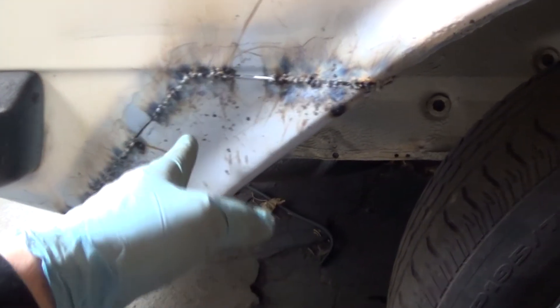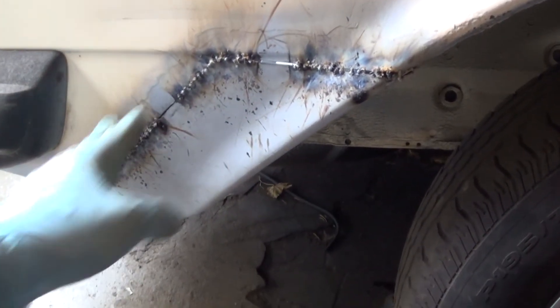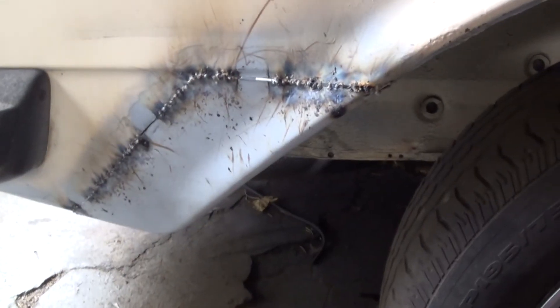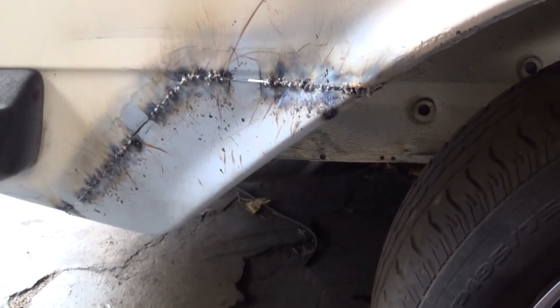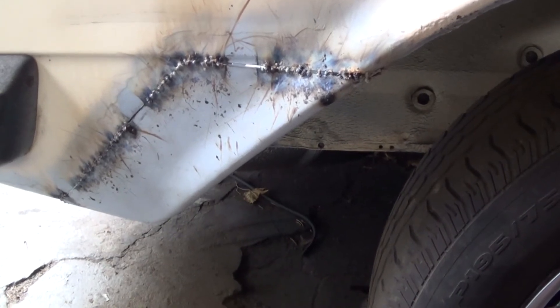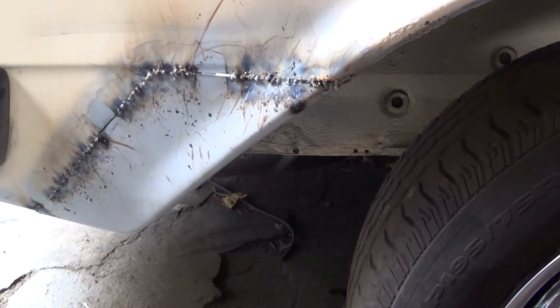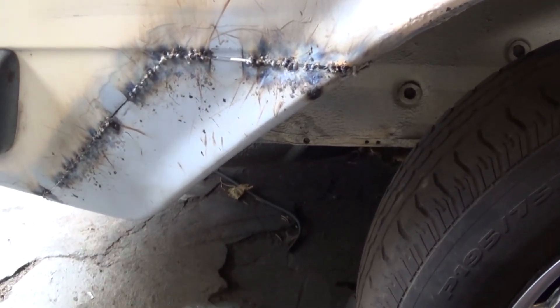What you see here is this panel really firmly in place now. All I did was a few minutes of tacking around the edge here. Still looks ugly obviously, and the weld is not completed yet. But what I'm going to do right now is hit this with my grinder to clean up what part of the weld already exists and then continue filling in gaps.